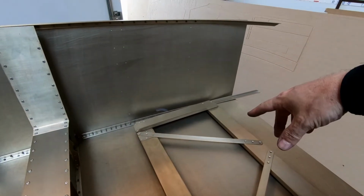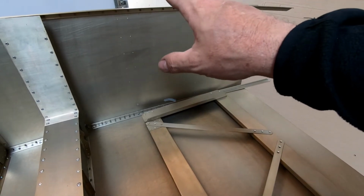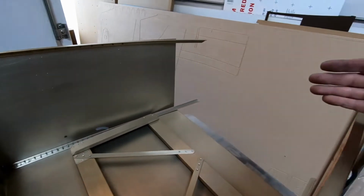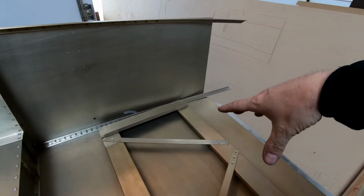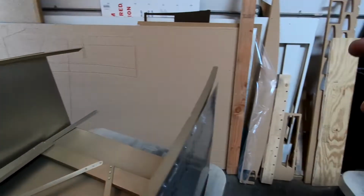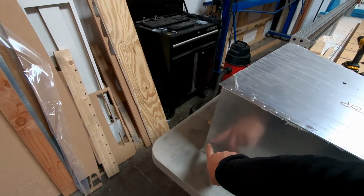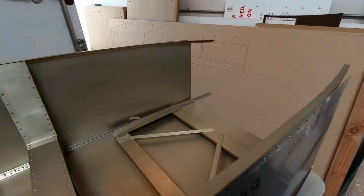The reason that we want to get frame 7 completely installed, obviously, is because we need to work on frame 5 and frame 6 in here and get the seat pan and everything set up, and we really don't want anything to move any longer from here back. We should be at a point where we can install frame 7 permanently and then later come back and take the rear fuselage, slip it onto the end, and then final rivet the rear fuselage skins all the way around and glue that all together as it mentions in the manual.